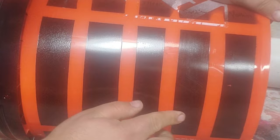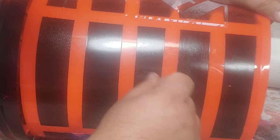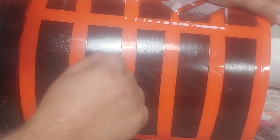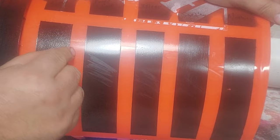This is sanding. While you can see the sanded surface, that paint is on there really well for the fingernail test. This is the xylene and contact cement — you can see I'm marring up the surface with my thumb but I'm not getting the paint off. And then this is the purple primer — again I'm scratching really good with my thumb and I'm not getting the paint off. This is the 3M spray adhesive — this is the worst of the three. Obviously I could just take this off. This is better than nothing, but yeah, that just comes right off.